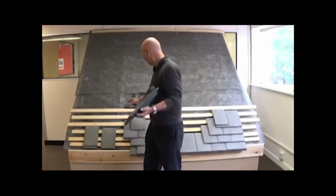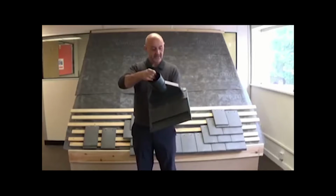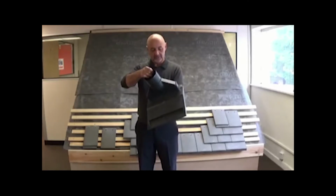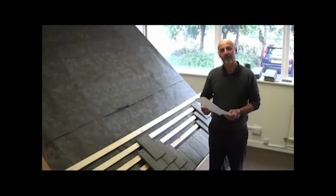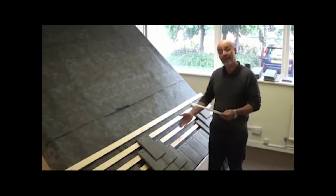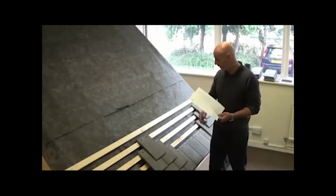If that's removed, you can attach the adapter, which would make it the UB37, which can be connected for soil pipe and for ducting of small vents. Installing the UB8 plain tile vent requires no batten cutting whatsoever, according to the fixing instructions.